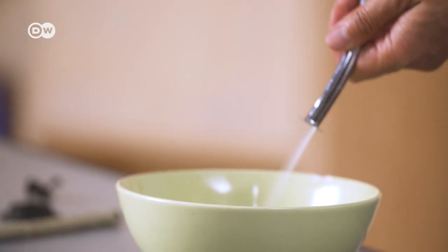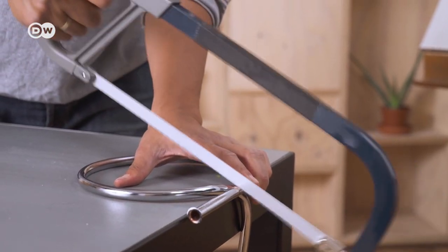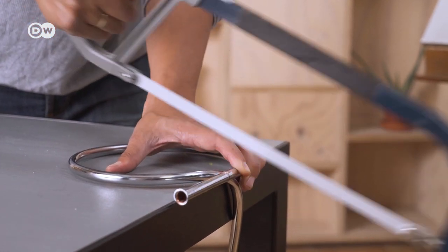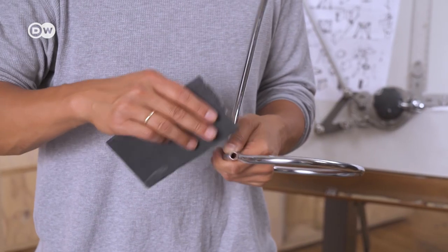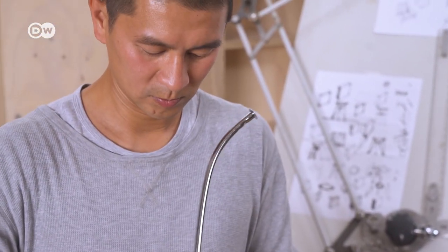Let's get rid of the salt. If you wish, you can cut the excess straight section of the pipe at the base. If inexperienced with a saw, I recommend using a clamp to secure the pipe to the workbench. Finally, use sandpaper to smooth the sharp edges.